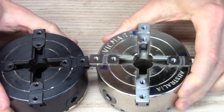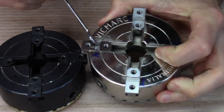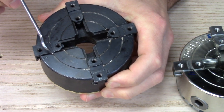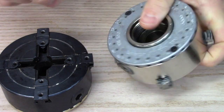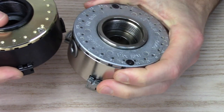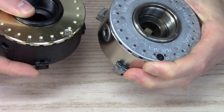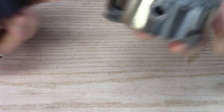To demonstrate this: comparing where the slot is on the backing jaw, on the Bicmark it extends past a reference line on the chuck body, whereas on the Bulldog the inner edge of the groove is within that line. Flipping the chucks over and looking at the forejaw, the threads are cut a little differently on each one — they didn't do an exact clone. I won't be able to eloquently explain the difference, but you can see they're simply made differently, thus letting the Bicmark come out a little bit more.